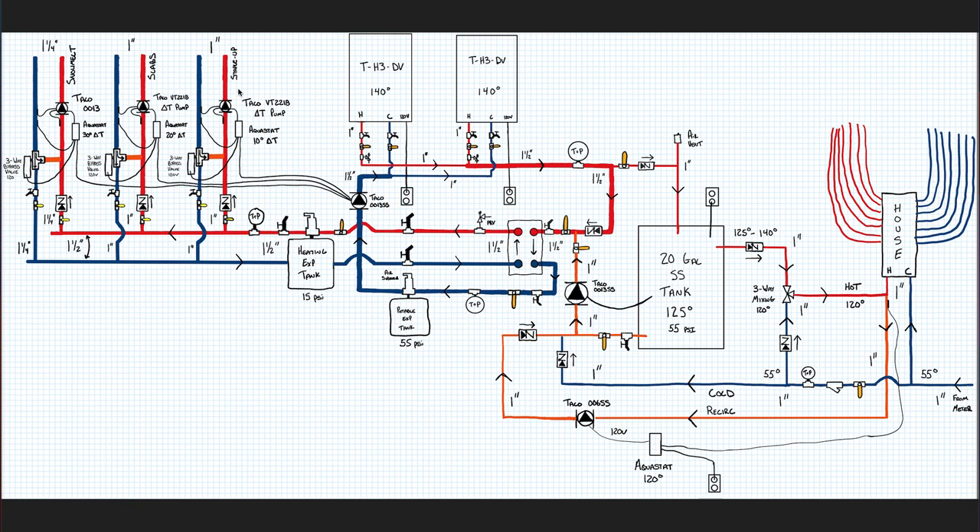This is the whole concept of continuous circulation. As the house, garage, or rooms lose heat to the outside, the return glycol gets colder. The colder it is outside, the more heat is lost through the building envelope, and the more frequently the system will cycle to replace it. There's no traditional thermostat — the aquastat monitoring return glycol temperature acts as the thermostat. It's all automatic, and so far it works very well.